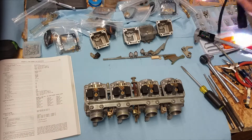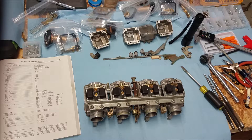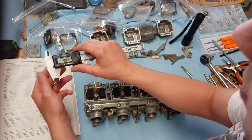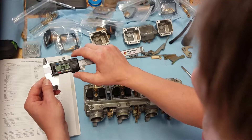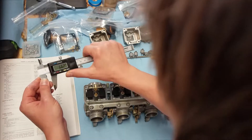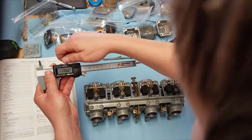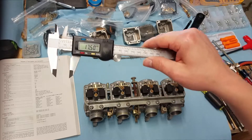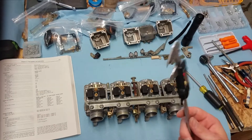So how we're going to take that measurement is with the use of a Vernier caliper right here. We get it zeroed out and then we're going to take it all the way to 17.5 and lock it down — screw that tab in so you can't move it — and we're at 17.5.